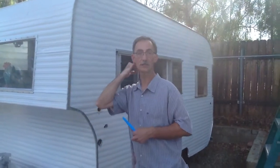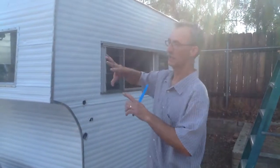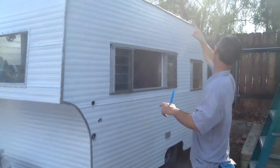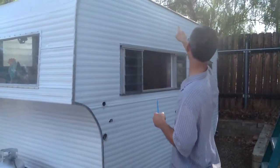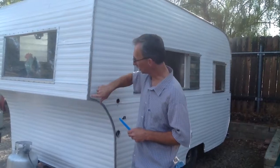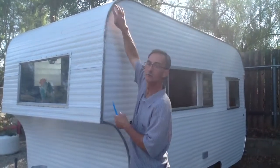How did you do that? At first I started out using a heat gun — I don't recommend that. The problem was that in order to heat it up on the ground and get the correct angle, I had to go back and forth, and that piece goes from here all the way around to the other side, so it's a really long piece. It took so long just to get one radius. When I got to the edge I figured, let me just try it by hand — it worked beautifully. What you need to do is put a screw in to hold it when you get to the radius, then take your thumbs and bend it as you go, put a screw in, bend it as you go, put another screw in. You'll get it perfect.